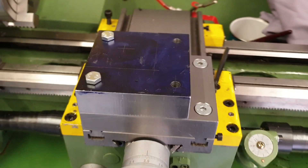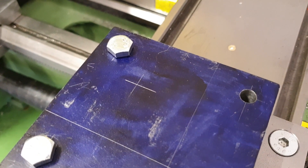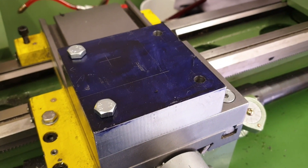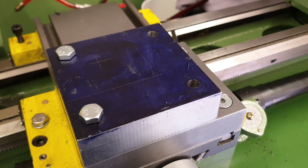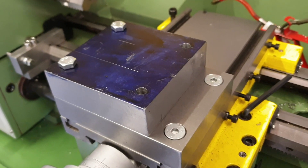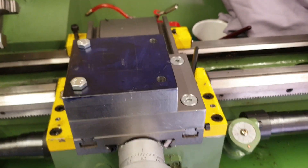I need to consider exactly how I'm going to do that. I could put the top plate in the four-jaw and offset it so the centre point is the centre of the tool post. I'm not sure that chuck is actually big enough and I'm worried there may be a little bit too much out-of-balance mass rotating on the spindle, but I'll give it a go. The other option is to drill and tap it and then mount a threaded shoulder into the tapped hole — effectively just put the top plate in the four-jaw centrally to remove the three millimetres I need to get off on the thickness. I'll give it some thought and decide how to go.